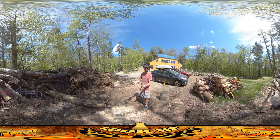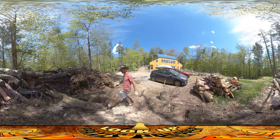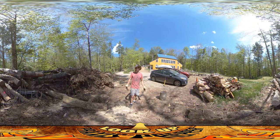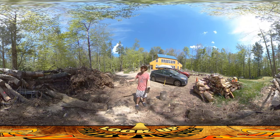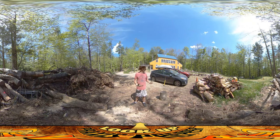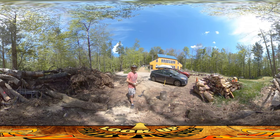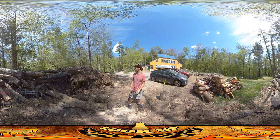It's kind of back and forth where I'll scoop some of the dirt out with the tractor and haul it up over there, and then there are these logs that have to be moved out of the way and stacked over here so we can use them as firewood. A lot of the stuff here is not the best firewood material — it's white pine. White pine is going to throw a lot of creosote up into the chimney, but I'll scrub the chimney out. The more dry I can get the stuff, the less creosote is going to accumulate. The worst kind is wood with a lot of pitch in it, like wet white pine — that's the worst situation for creosote. So at least if I can dry it, it'll be that much better. I don't want to just throw out this great resource when I need firewood.